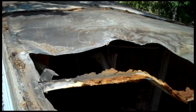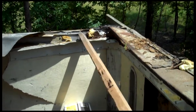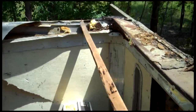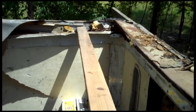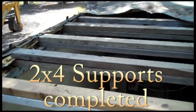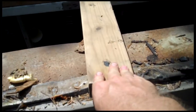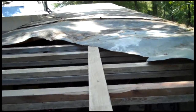Now you can see where I came down the side with that sawzall. Everything is off of here now. What you're seeing on the side is an expansion here. We're going to put boards — we're actually going to lay them down like this and wedge them in pretty good. You can see what we've done: we've got the 2x4s doubled all the way down, and then we have a 2x4 going down through the middle.